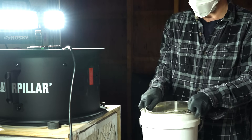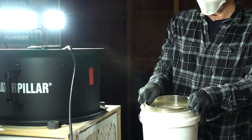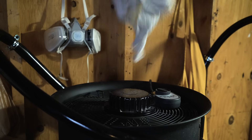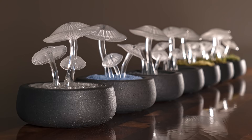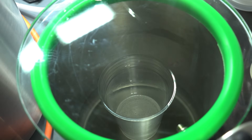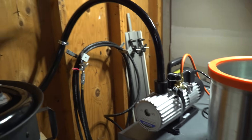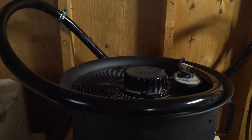This design is able to pull in dust from a much greater distance than the box fan options, so after all these tests, it's still the filter of choice for me. It's easy to clean dusty rags, parts, and much more while working with castings that I want to keep flawlessly clear. Another casting-related use is to filter the oil vapor out of the air while using my vacuum pumps to degas resins and mold mixes. Before setting up this exhaust tube there was a noticeable smell of burning oil — the filter removes that smell completely.